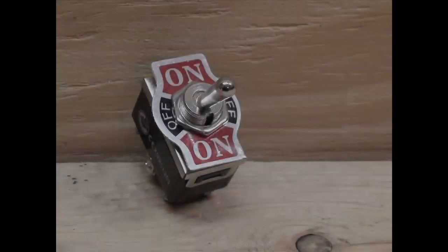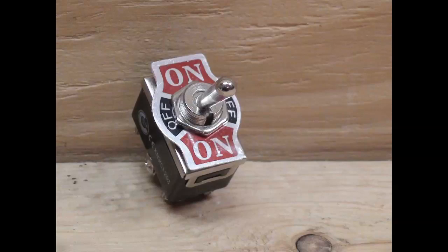And now the double pole, double throw, on, off, on toggle switch. With this power supply, it is recommended to start at the transformer and work towards the fuse holder. The toggle switch is much more meticulous and will become difficult to work with if all the other components are already in place. On that same note, this is the more tedious portion of the tutorial, and being familiar with the electrical diagram will help you follow along.